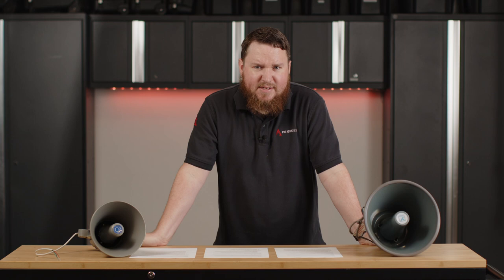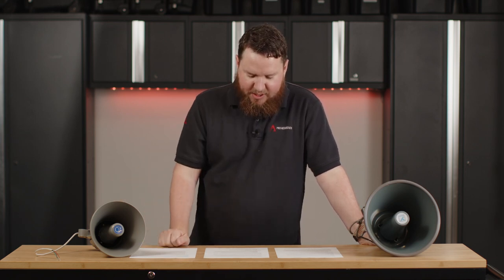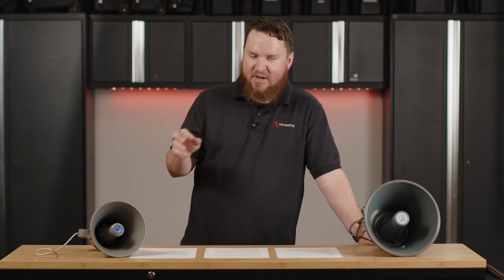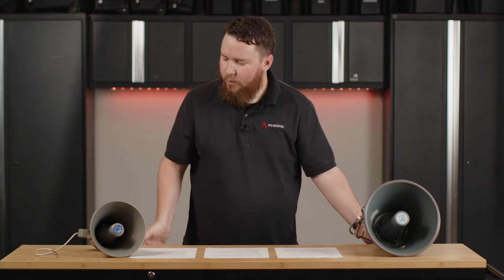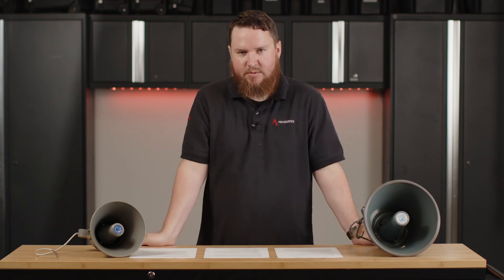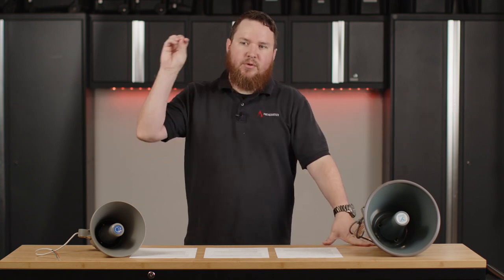There are a lot of different ways that horns can be built beyond the models shown here. There's also parabolic, conical, exponential, hyperbolic, and stepped horn patterns. The idea is that we can have all-in-one horn speakers, but we also have separate compression driver plus horn flare type speakers that we can use to cover a very wide area or throw sound hundreds — sometimes thousands — of feet for a very large area, like a fairgrounds.